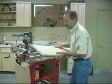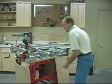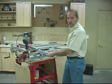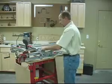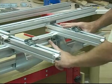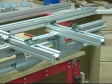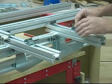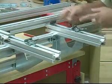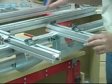An alternative is to use the horizontal vices, which are now available for the REVO as well as the 912 and 1800. The horizontal vices mount a little bit differently on the REVO. It'll mount on the face of the front rails here. So you use the corner brackets and attach them as shown here. Then, of course, you can adjust your clamps in here. We normally just set the back clamp all the way to the back side.